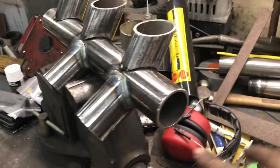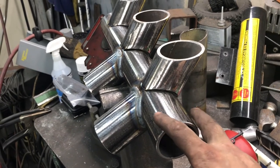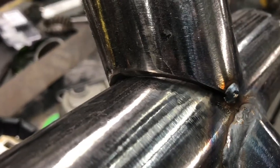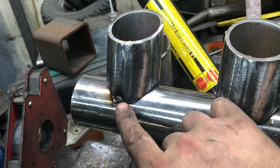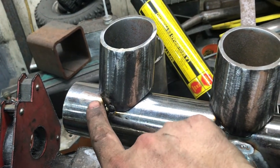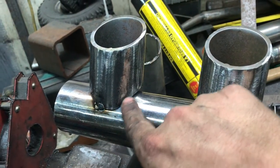What I was talking about earlier — doing the fish mouth or the cope out in this manner using the 45-degree cuts and just opening it up — tell me that's not perfectly weldable. A very inexperienced welder can do that. Especially out here in the corners, you've got this nice little back bevel to fill in. And your material is thin right here where you thinned it down with the grinder, so you can just go a little bit high and work your puddle down onto the thicker material and get a real nice clean burn all the way around.